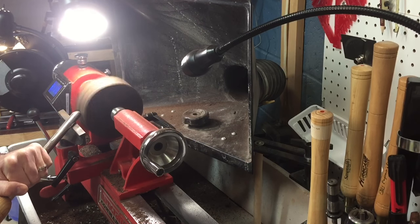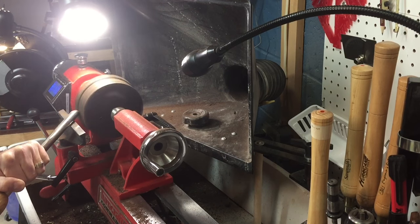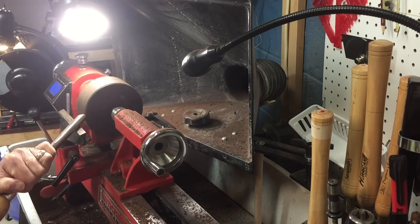Another tip on this Wenge wood is that I'm using a lower speed than normal and taking deeper cuts than I usually would. This is to help out with the dulling of the tool, so I don't have to sharpen my tools every 2 minutes, at least until it's been rounded out. And I'm cutting inwards towards the headstock to avoid splitting some of the fibers.